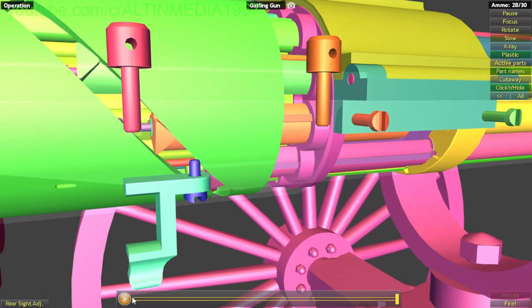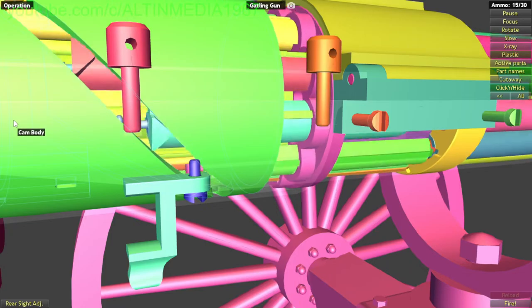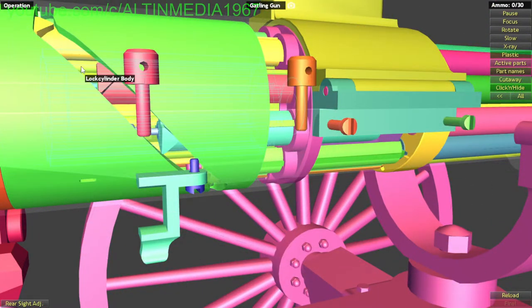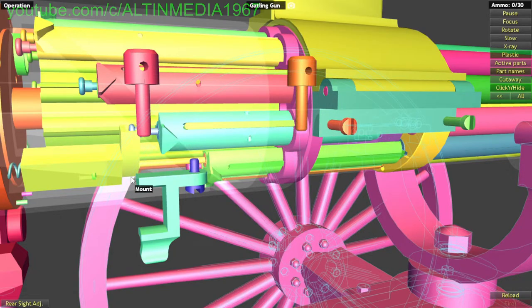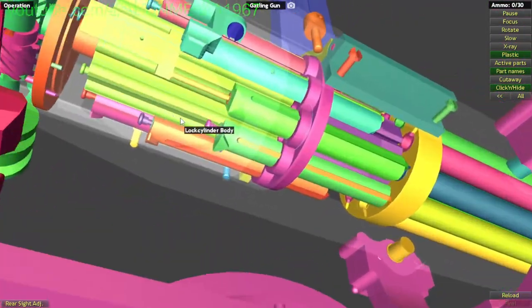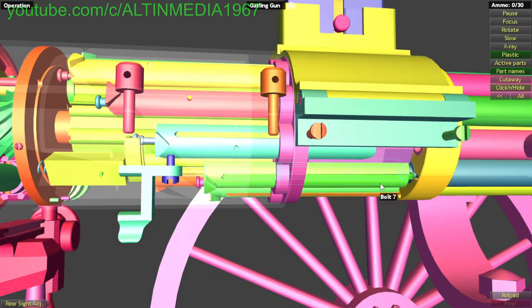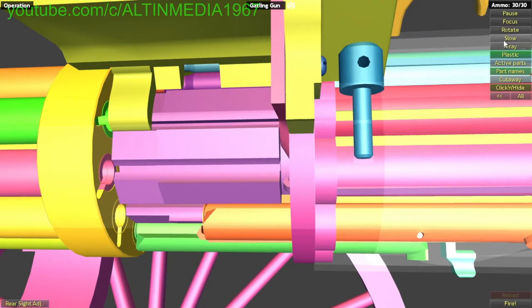Let me fire everything. The crankshaft, crank washer, worm gear, and lock cylinder body all rotate together, making the bolt go forward, pushing the round into the chamber. The cocking switch holds the firing pin until the bolt reaches the lower position, then releases it. The firing pin hits the primer, the round fires, and the cycle continues.